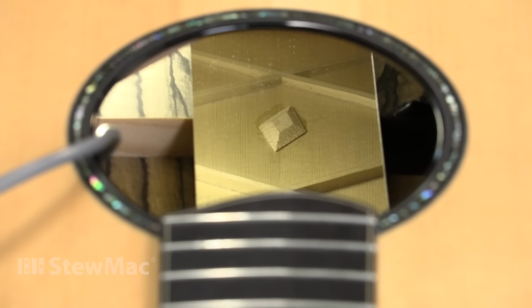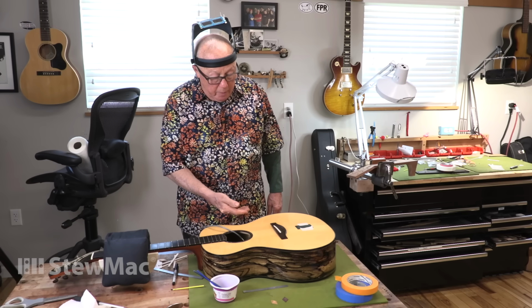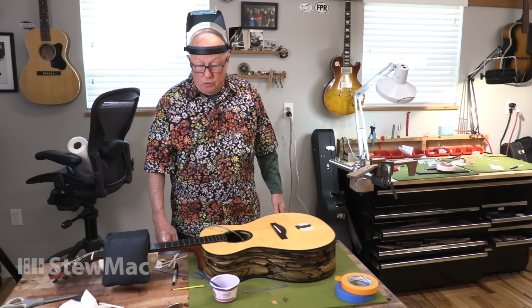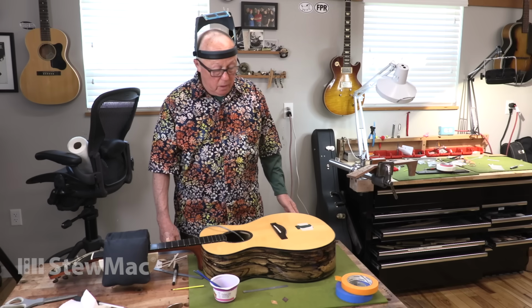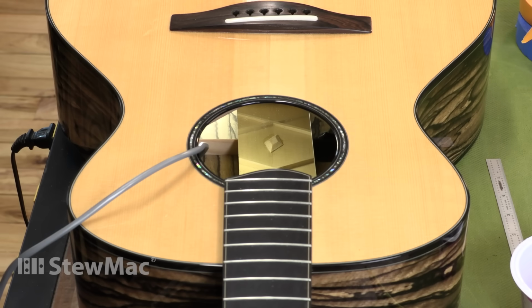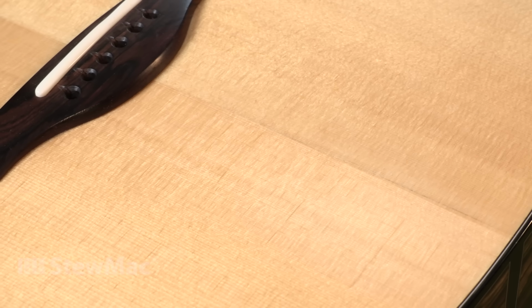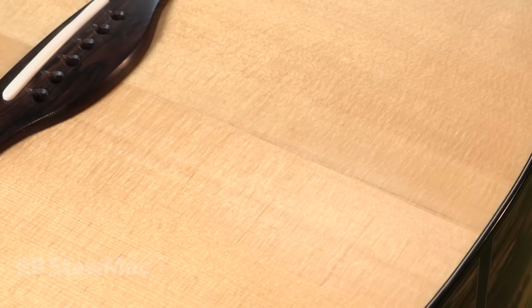You can also see towards the back side about a 1/4 inch of little glue smear where I first hit and then I pulled it back on center. That's hardly any glue, and I feel really good about the way it's held already. When it's dry, I wouldn't try to mess with it now and knock the cleat off. I can go in there with some hot water on a rag and clean that excess glue out. That did it. I'm not going to touch this for 24 hours, let that dry. That looks good and it'll stay put.